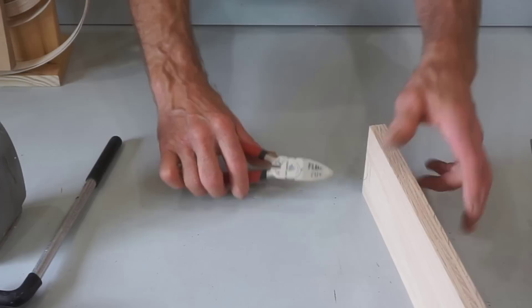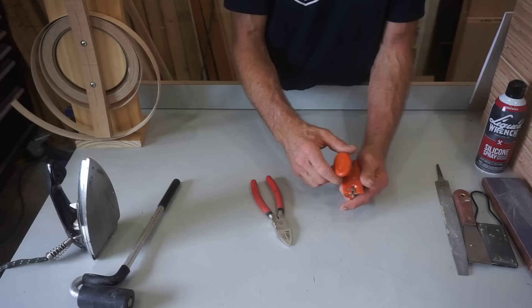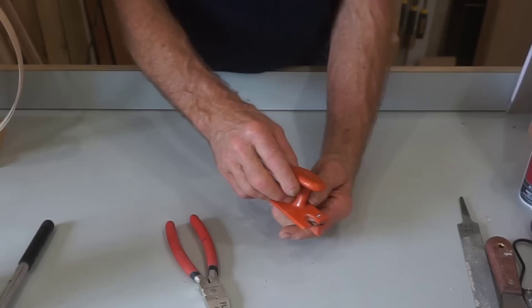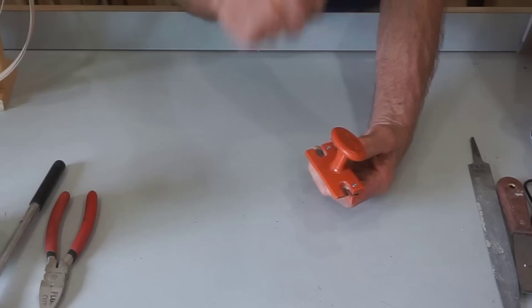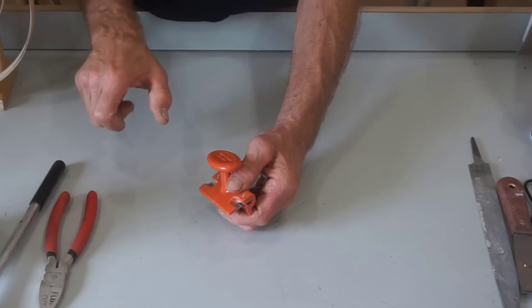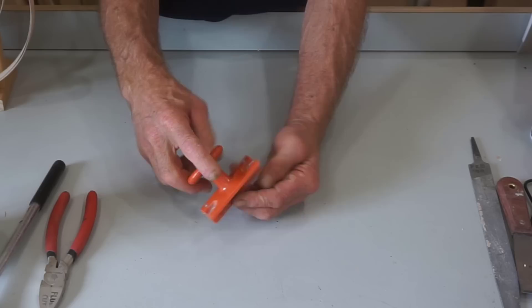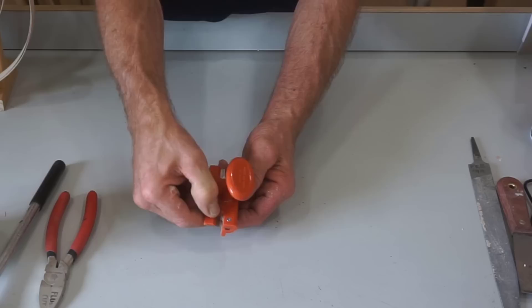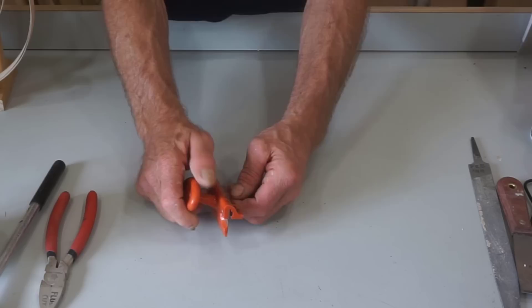The next tool is a trimming blade. This trims the excess edge banding off the edge of the shelf. There are a lot of these on the market. Most of them try to get fancy and have a double clamp system where it trims both edges at the same time. But I find with those cutters the blade is thin and flexible, and if you don't have the touch just so, it digs into the wood — and no amount of digging is worth the little extra speed you can potentially achieve by trimming both sides at once. I've had this for four years, just resharpened the blade the other day. It's inexpensive, reliable, and does a great job of flush trimming. That's the only one I use and recommend.